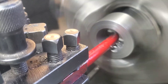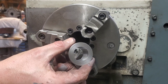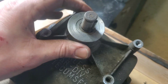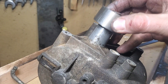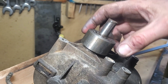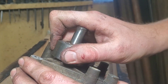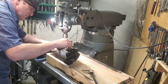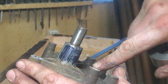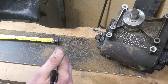For the moment of truth — spoiler alert — this is gonna fit and it's gonna fit perfect. I probably couldn't have aimed any better for a fit than this, and I'll show you how to check that as well. How we're gonna check this is we're gonna use the Sharpie again and paint it with the Sharpie — we could use layout dye or Prussian blue, but we're just gonna get a quick view of the layout here. Basically, these two parts are gonna rub together and the high points are gonna take away the Sharpie. We can see there's a small bulge in the casting there because this isn't perfect, but that's a pretty good fit.